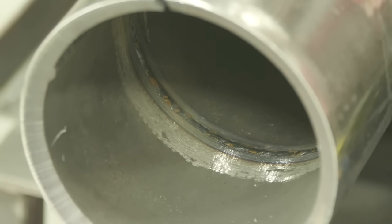I came in here with the grinder and knocked the top edges off the little glass. If I was running 045 flux core, I'm going to blow all that stuff out of there anyway. You can flush this up with one pass, then turn right around and do your cap.